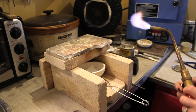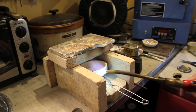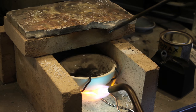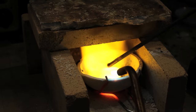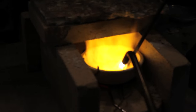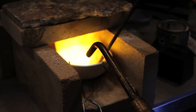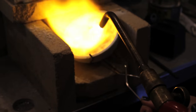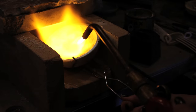I'm going to go high, go in here — it works quicker if you heat the stones up ahead of time. So here I've got the borax starting to melt. This is a carbon stir rod — it doesn't melt. I heat it up while I'm heating up the rest of the borax, and I'm going to use it like a spatula and try to spread it. It's not hot enough yet. When this starts to melt more, I'm going to spread it along the walls of the crucible. You can also tilt it and have it run down the sides. It takes a while to do this, so give yourself a half hour to prep a crucible. I'm going to have Sugar now show you how to do the casting, because we've already got a couple of cracked crucibles, so she's going to actually melt the metal for you.